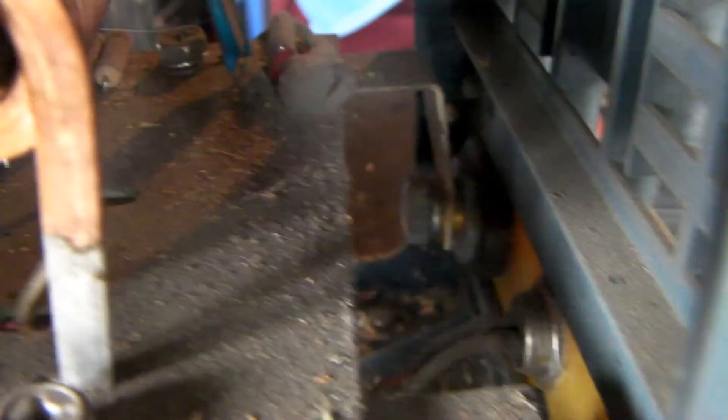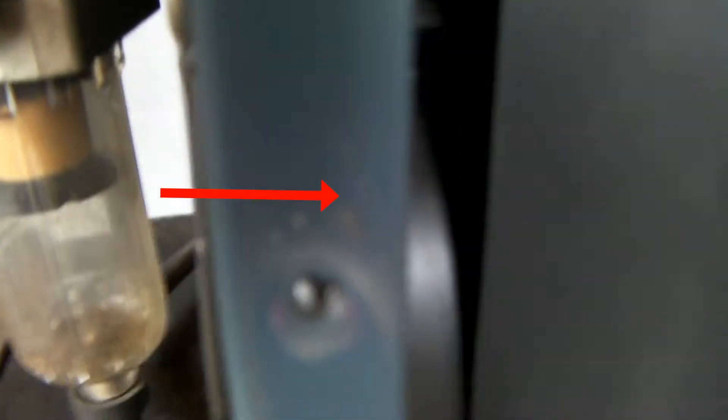Look at that — that's all metal filings in there. They come in through the back via the fan, which sucks air in from that direction and blows it out this way. Here's the other side — pretty nasty. I'd suggest you blow this out every two or three months if your machine is in a workshop like mine where there's all sorts of stuff floating around in the air. All that stuff stuck in there is one big short circuit waiting to happen.